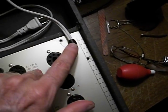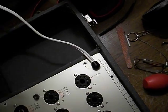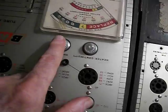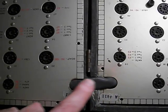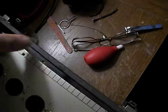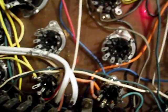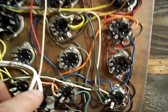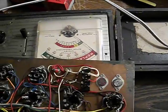Progress being made. I was able to salvage this little right-angle strain relief and put a new AC cord on it. Got the correct bezels and lenses for the indicator lights, got the correct knobs for the switches. There's heat shrink showing through. I've got the umbilicals put together — soldered and cleaned all these, soldered all the wires, cleaned all the pins to make sure they get good contact. Here's the new AC line cord soldered into the appropriate spot, used safety wire to keep it dressed properly. Put some cleaning lube on this switch that was a little bit sticky.